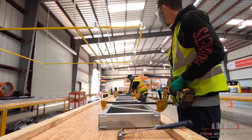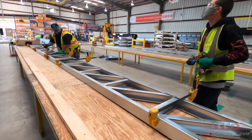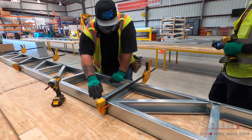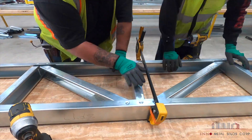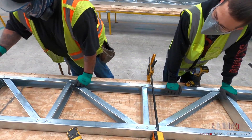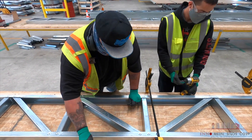You want to hit all your verticals first because that will keep your truss in line and straight. When I say verticals, it's these right here — all the threes in your number system. You want to hit all the verticals first so that your truss is as straight as possible and has no bends or kinks in it.